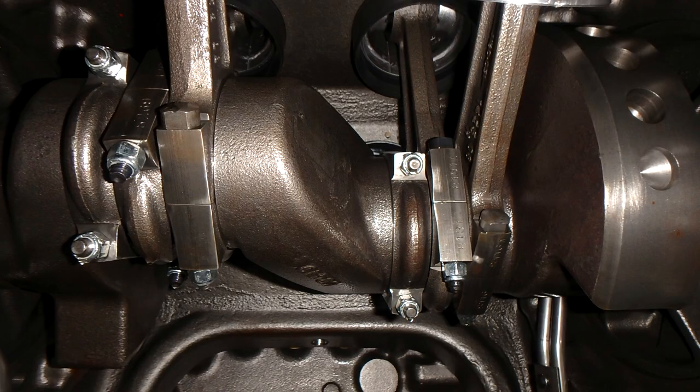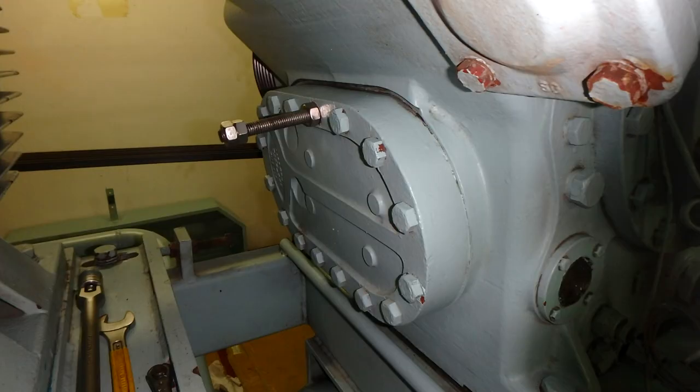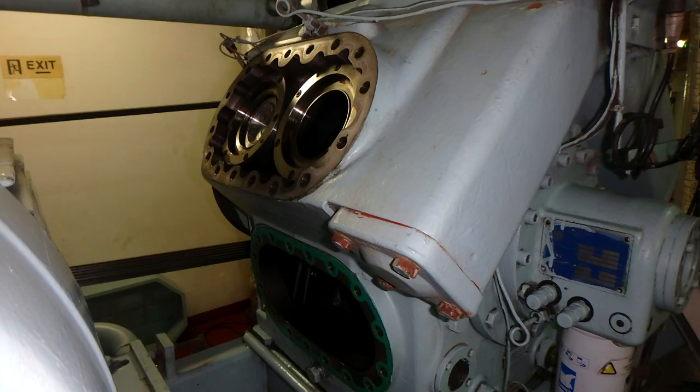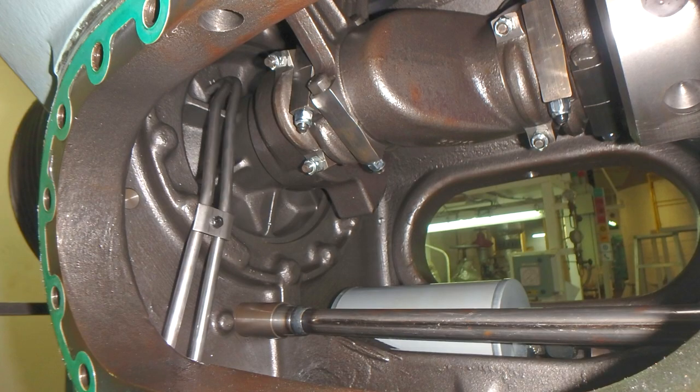Leave it for 1 day or 2 days to verify that your pressure from vacuum will not drop, will not increase to the atmospheric pressure. So if the vacuum remains inside, everything is good. You can fill oil and you can also connect the line. You can open the valves so all the line will be connected to the compressor, and then you can perform the test. First start in the first stage. And also before start, leave it 1 day to see what's going on in stop condition.